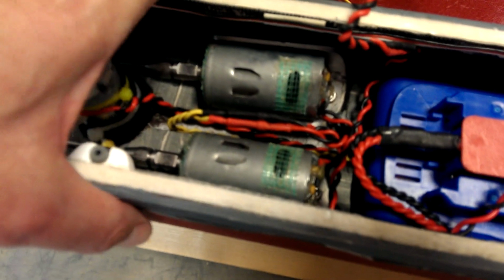Some features of this is you'll notice the areas that are open on the motor I covered with this green mesh, which is actually fiberglass drywall tape, and it's glued onto the motors. This keeps the BBs out of the motors, because BBs will come in. Well, sometimes they may get past the internal screening, which I'll highlight later, and that's just a little reliability issue.